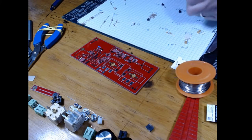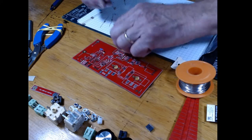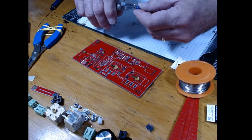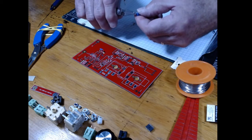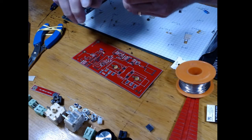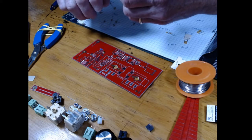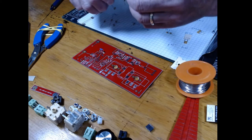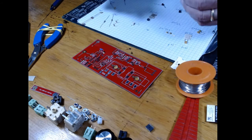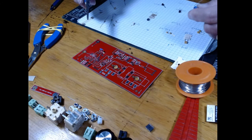These are probably the weirdest parts because they're so close together and there's only 2 pins. So you do the exact same thing. You pull them out. I like to set my parts at, you know, 1/8 to 3/16 of an inch off the board. So you just sort of spread those out, make it nice and even, and then maybe a little bit more height.